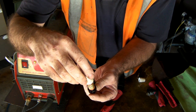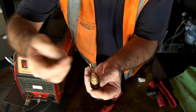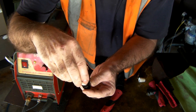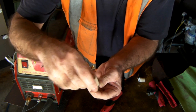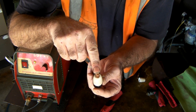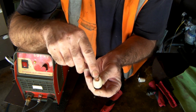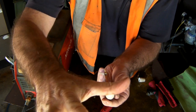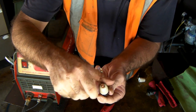The shield not only holds all this together, it's got a rubber seal on it. When you screw it up, it creates a seal so no air can get out the bottom. It forces all the air out through this little aperture — the hole in the end of your cutting nozzle. The smaller that hole, the more force it pushes the air out, so the more cutting power you've got.